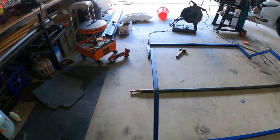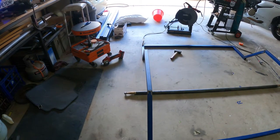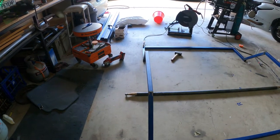Now, it is going to be ridiculously close. Now, they say that they need about 50 mil of clearance from the inside of the wheel. Now, running VE wheels on the hubs that I've got, it's going to space that out a little bit further, and then there are four and a quarter inch backspace. So I think roughly with the measurements that I've got, making the deck width 1550 like I wanted, I'm probably going to have 40 mil of clearance.